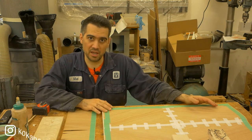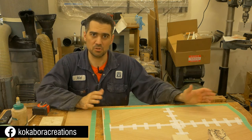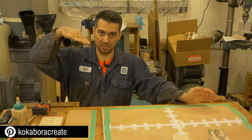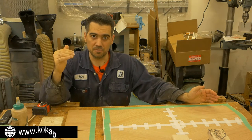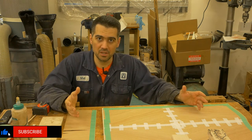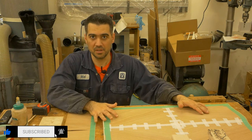When I originally began the veneering part of my work, the instructor simply said it should look like spilled milk. That's not scientific enough for me. I mean, if you spill milk and the surface is a little bit concave, that's going to look a lot different than a completely flat surface. But in both cases, spilled milk has a particular volume. So I just needed to find out the right volume for my project to glue it properly.